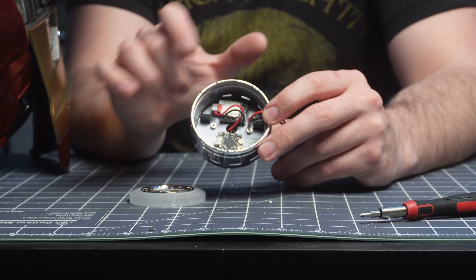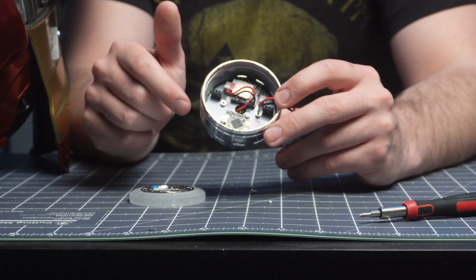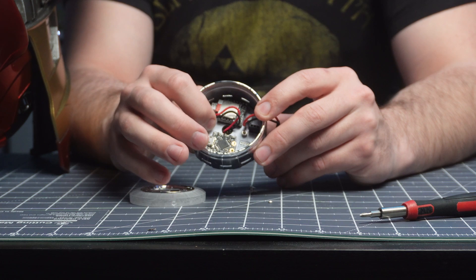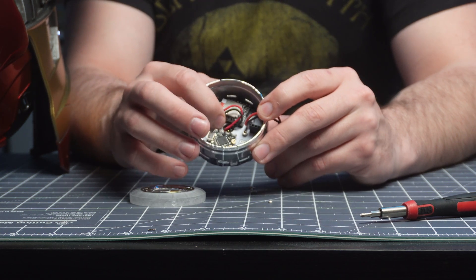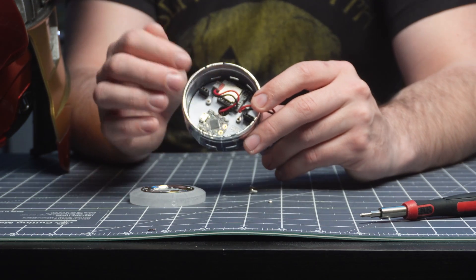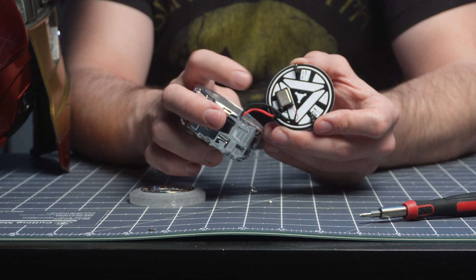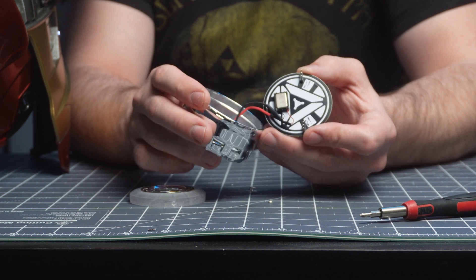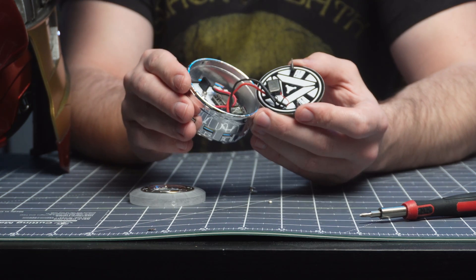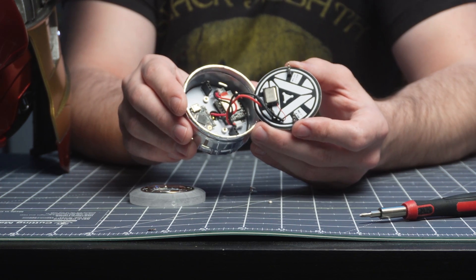The code is essentially a reworked Crashworks code. If you wanted to, you could add a button switch to turn off the NeoPixels and trigger a sound effect of the arc reactor booting down. There are three holes — two screw into the 3D printed part to keep the PCB in place, and one center hole feeds the wire from the pogo connector to power the board. I also have a tiny 3-ohm speaker glued to the underside of the NeoPixels — the exact same speaker I used in my Tron Identity Disk project.